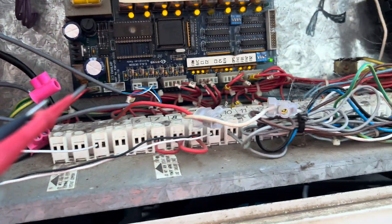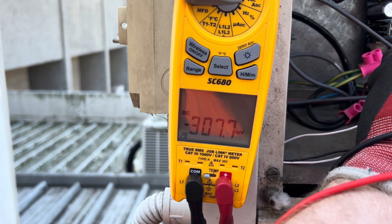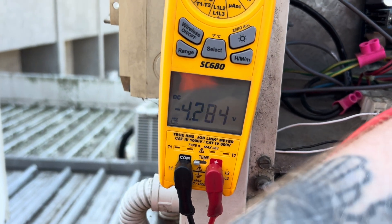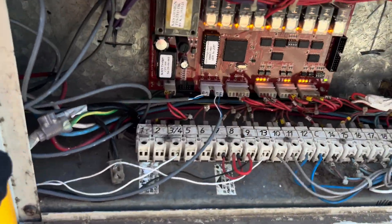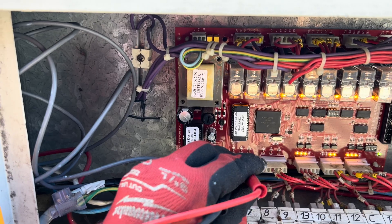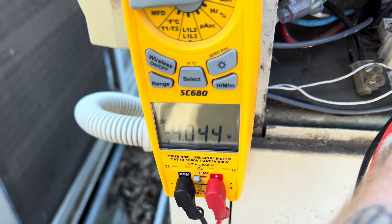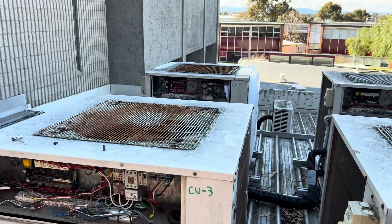Killing power and quickly testing voltage output on the other sensors. Discharge is reading millivolts — which should be fine since above 67 degrees is around 0.8 volts. That one is 4.2 volts which is probably in the negative range, so that seems fine. These two appear to be reading okay. That one needs a new coil sensor, and that one needs a new coil sensor and to be left off to defrost.